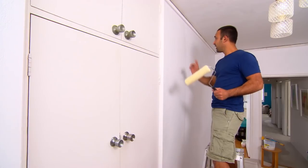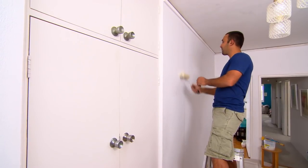You'll notice I've got a plumb line on the wall where my first sheet goes. When you're gluing up, go about 50mm past that line so you get good adhesion on the edge of the sheet.